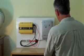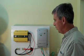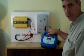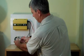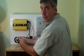That's the whole system wired up. Let me show you a little exciting part about this: say it's been cloudy for a little while and the array hasn't had a chance to charge up our battery. You can put your battery charger right next to it, plug it into the house, and just go straight to the lugs here and charge your battery instead of having to go outside and do it in the cooler.